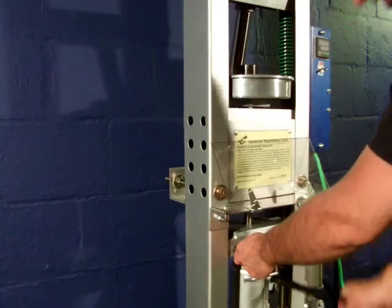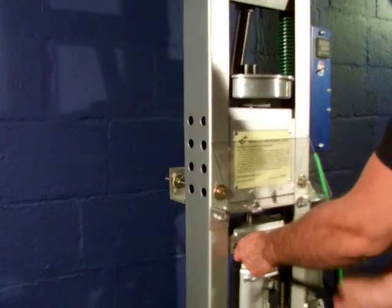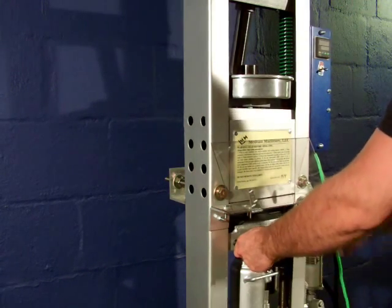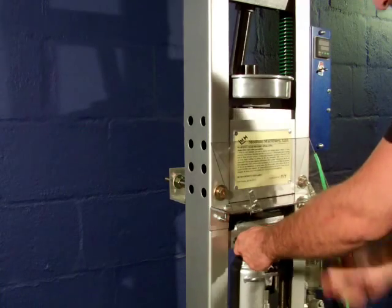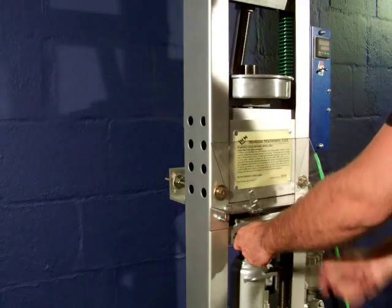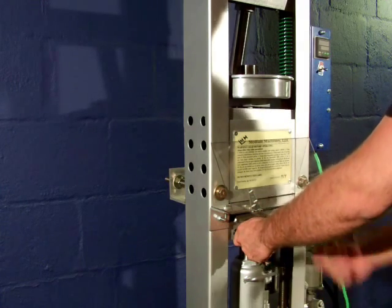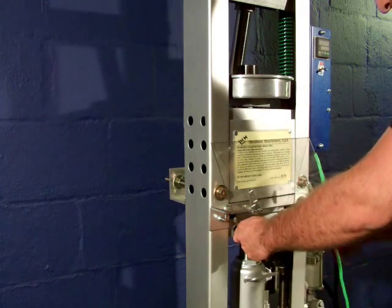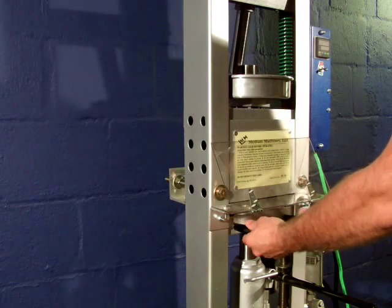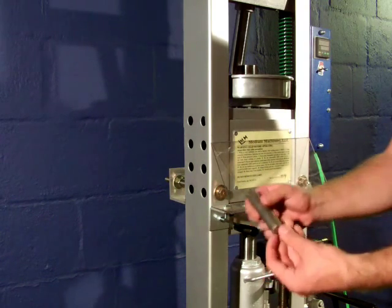You can see we keep pumping this hydraulic and the plastic sides are going to keep coming out from the top — there's a little bit of plastic coming out with it. Pump it all the way up and eventually you'll stop moving since you'll run out of length of extension. In that case, retract the clamp and use a second extension.